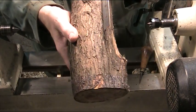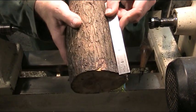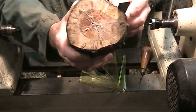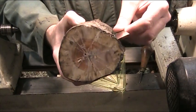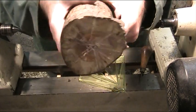Look at the way the thing's running, and then basically you forget about that part that's behind the thing and take your centre from there across. Where is that? So try to find your centre by ignoring the big lumps in the side, because that would leave you more wood on this. All right?